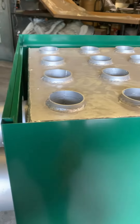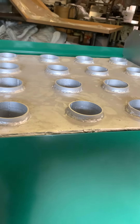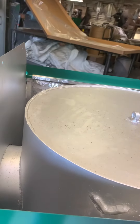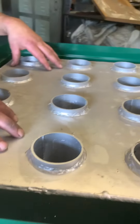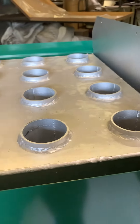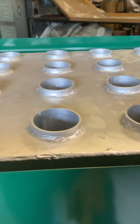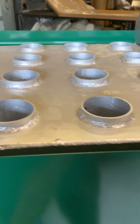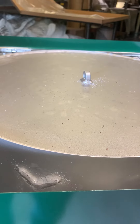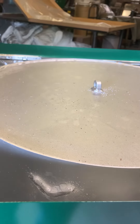Actually, let me correct myself — your cold air return comes down here, through the heat exchanger, into the blower, and then blows out. So it does go down through the tubes, through the fan, and then it comes up around the combustion area — this is where the fire is — and then goes up into the house as hot air.